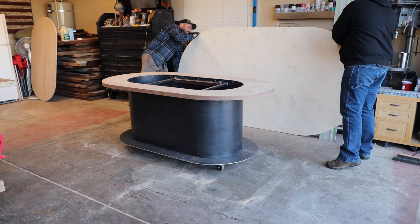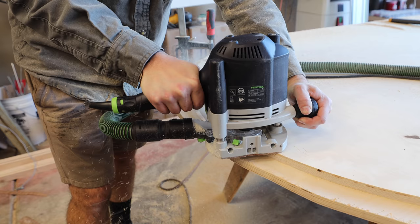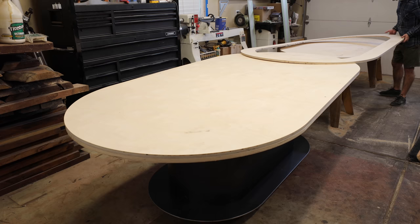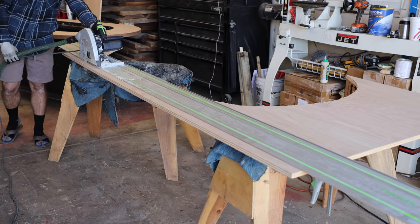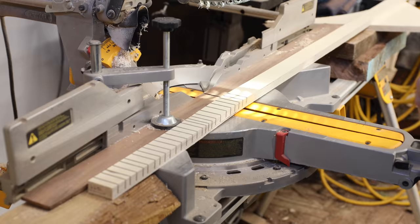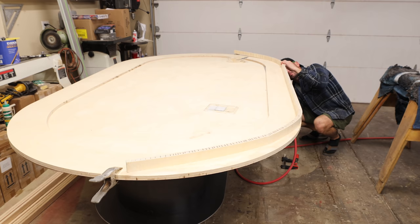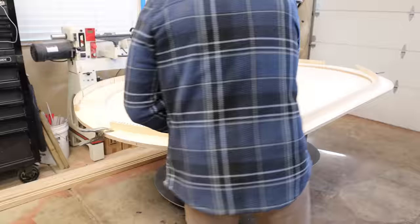This is an oversized table at nine feet by five feet. I used my same jig, cut out my half circles, and then used my track saw to rip down the sides. Had Roger help me put on the first piece to see how it looked, then I used that as my template to make a second piece that will sandwich the wireless chargers on the bottom of the top piece. Moving on to the actual bumper, I cut the larger diameter circle first so I still had center structure for the inner one, then ripped down each side with the track saw for the straight cuts — I had to make this part one inch bigger on all sides to account for the vertical parts of the bumper. Utilizing all the scrap pieces, I ripped down some pieces for the vertical parts and did a bazillion curve cuts so I could fit the contour of the bumper. I applied a liberal amount of glue, started in the center and walked all the way down to make sure everything was flush with the outside edge, keeping a ton of pressure on those two pieces to get a really good bond.